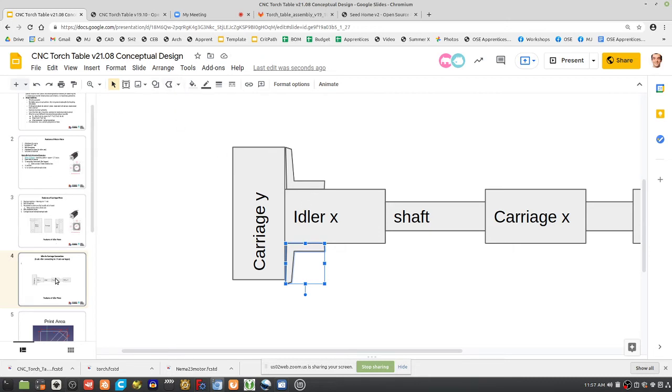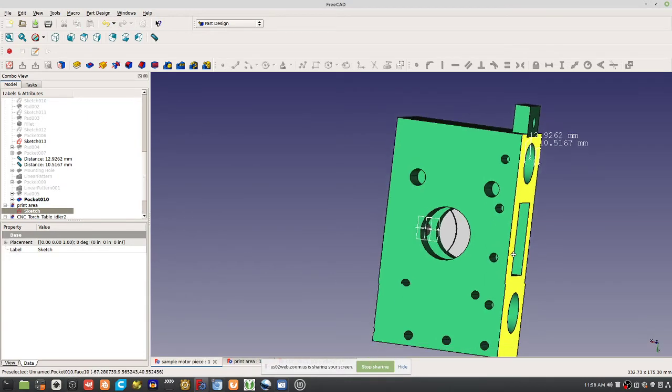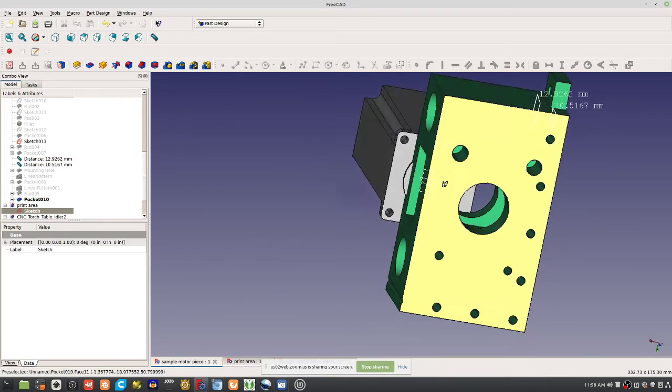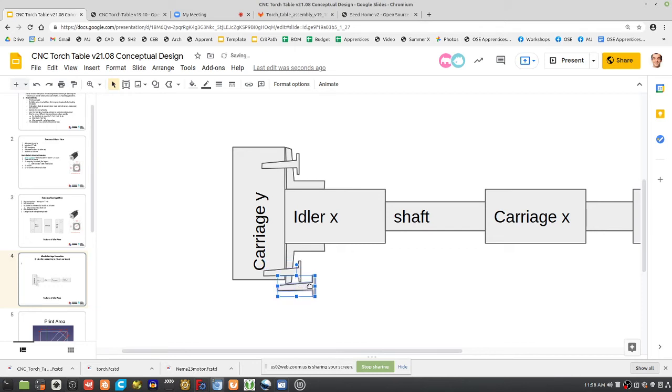So let's take out a bolt from here. Would that work? You do a bolt threaded into here, because we got those holes, right? We were already planning, in our CAD, on all these holes here, like these vertical ones. We can do a bunch of vertical holes, even. Yeah, something like that. So would this work? Bolts threading in like that, and they don't even have to go all the way through. They just need to thread in at least half an inch. I would like 3/4 inch for a very solid connection.